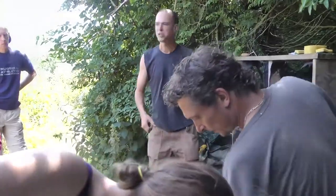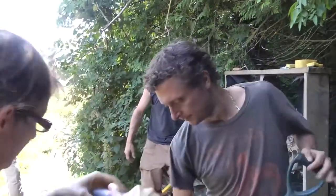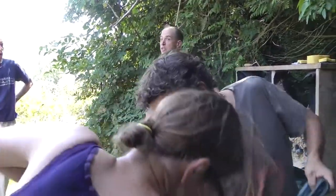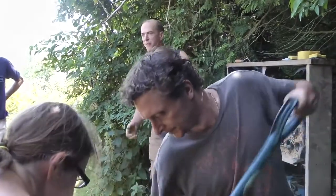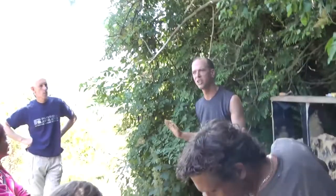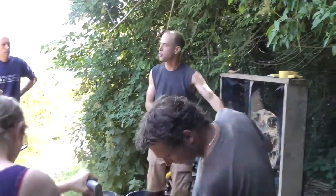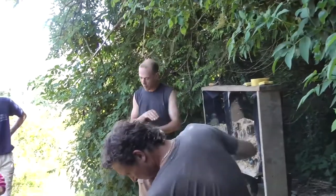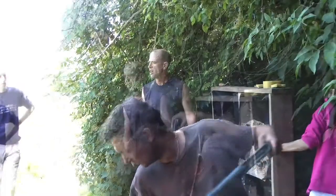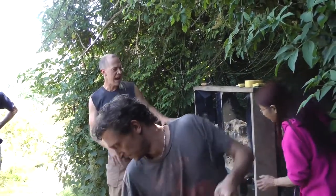That's another advantage to partitioning your wall with wood, is that you can do this run, that run, say there was more up here, whereas if I was just trying to do a single opening like you were asking, you would have to stop after about 3-4 courses, let it go hard, come back the next day, and do it again. So the advantage of the wood is to have many runs going at once, and so you can speed your work.